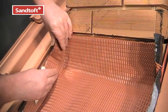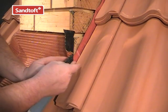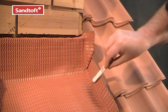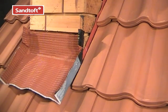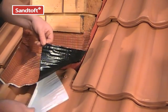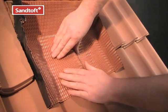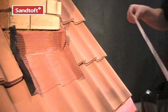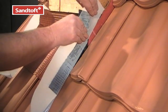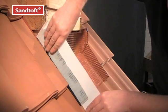To allow the Coraflex to turn into the upstand, we need to make a wedge shaped bend here. This should be folded in such a way so that any water driving against here is directed away. Once the flashing is roughly in place over the tiles and the bends have been made, the remaining paper backing can be removed and the flashing dressed closely onto the tiles. Once the front apron flashing is dressed into place, a good tip is to temporarily replace a portion of the paper backing over the upstands to protect the butyl until we install the side flashings.